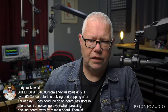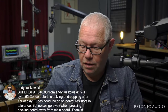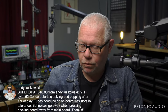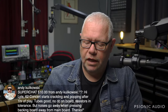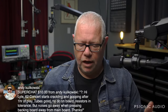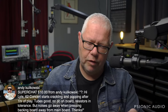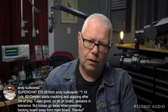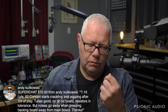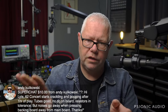The trick to that is, it sounds complicated, but it's really simple. With the amp fully discharged, remove the three screws typically that hold the board in place. And if you fiddle with the wires on the left side, if you're looking at the amp upside down into the chassis with the knobs away from you, if you slide the board to the left, the bottom board should slide all the way out of the amp. Take that board and basically soak it in isopropyl alcohol. You want to drive out any moisture contaminants in that.